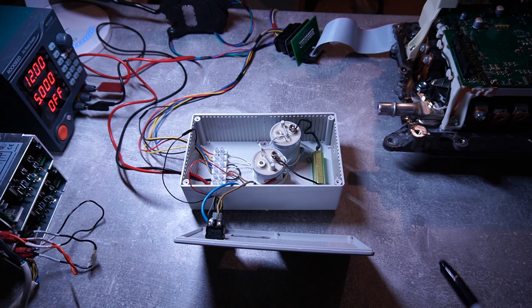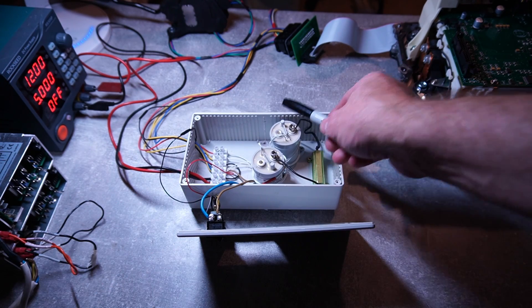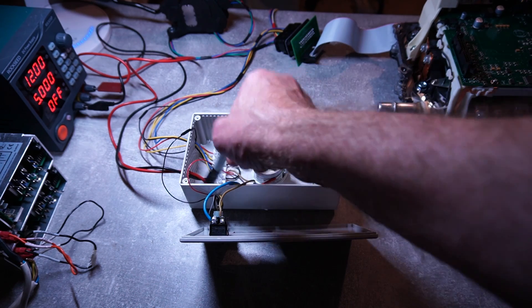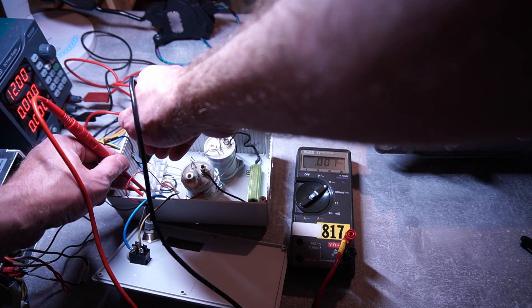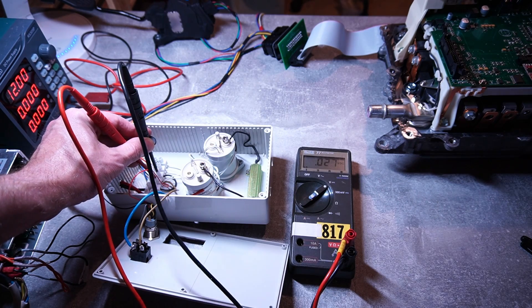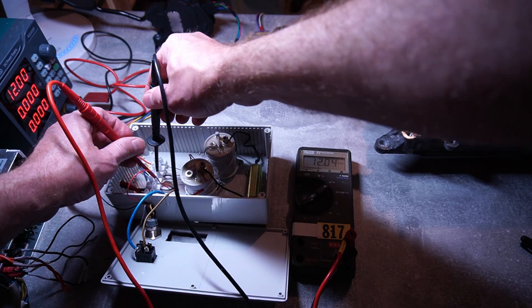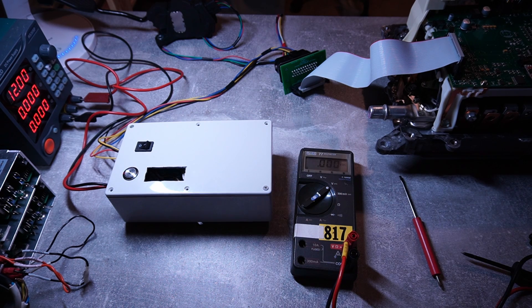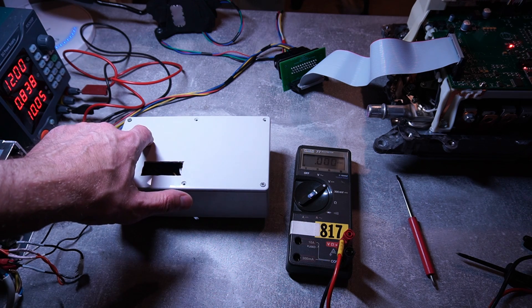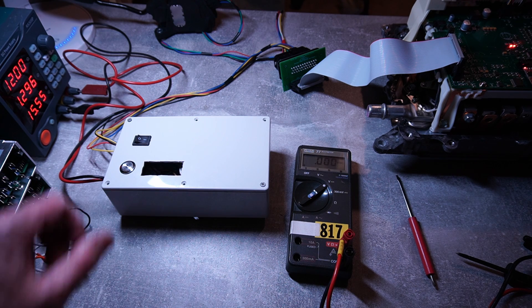This is the little project box I made. We have an on/off switch, a start button, a pre-charge contactor, a main contactor, and it's all connected through this distribution block. I've just switched on the power supply, so we have 12 volts on the input — this is the voltage after the switch, so we still have zero. Now if I turn the switch on, we have 12 volts here. I've put the cover on and connected the inverter — the power supply is on, the inverter is on, and one of the contactors is engaged: it's the pre-charge.